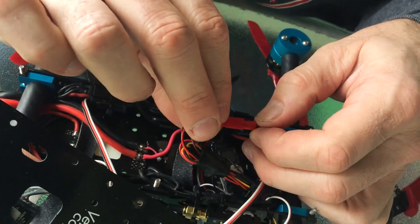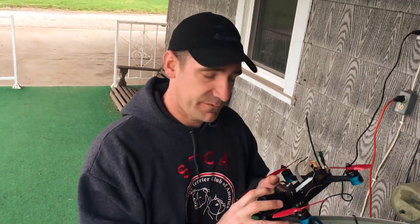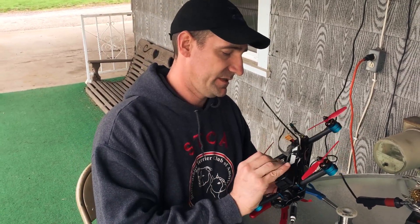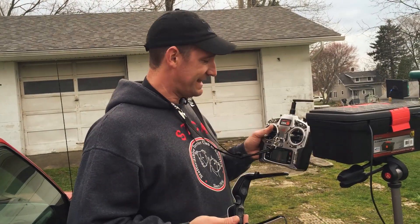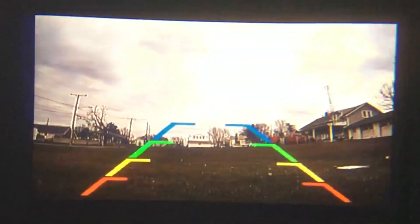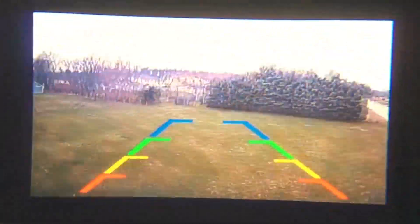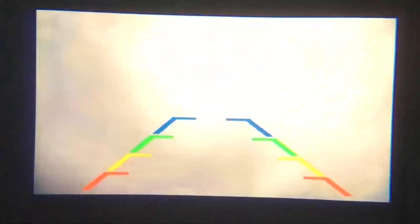So now I'll just plug my camera back in and button this back up. And that is how you install an LC filter onto your video transmitter and camera. Now we're going to toss a battery on this and see if it actually works. I just plugged in the battery — when the quad is not throttled up I always had good video. Let's look into the goggles and see what this sees. And it is literally perfect. That's the best FPV signal I think I've had in a long time.